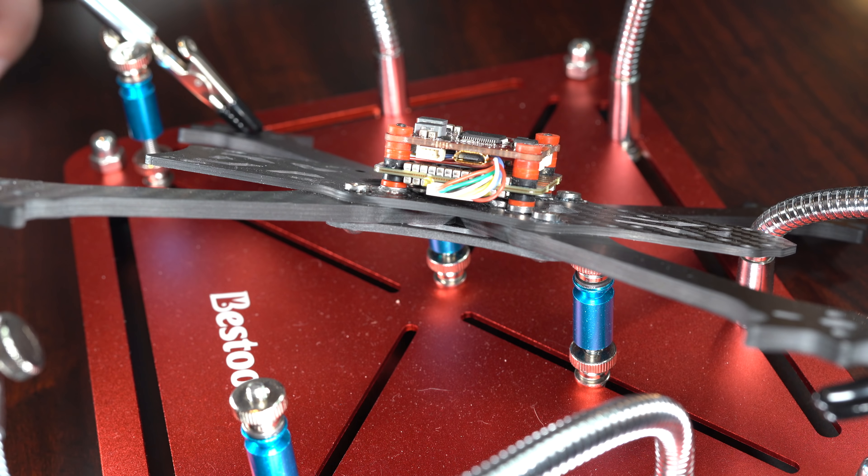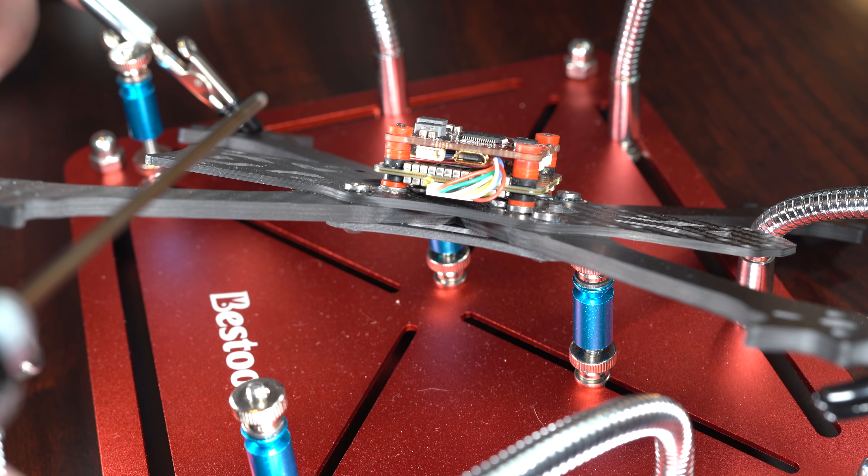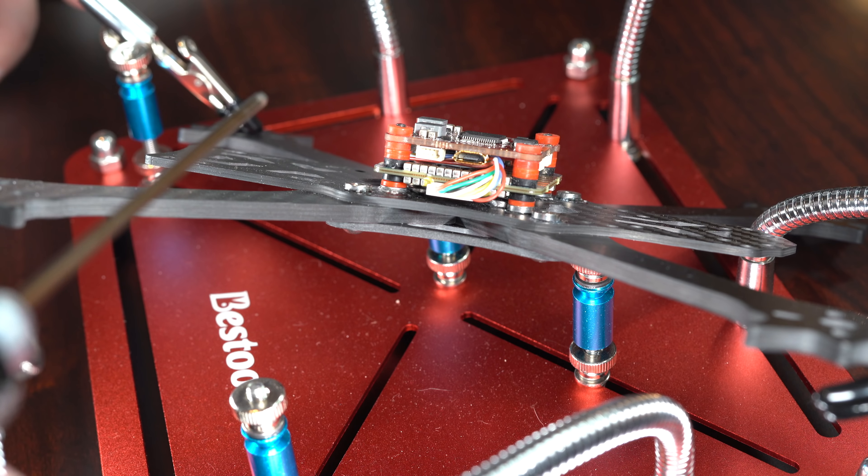I use skinny o-rings, though you might be able to use one thick o-ring in place of the two skinny ones. The key thing to keep in mind: only use o-rings — the gummies — in the ESC and flight controller. Don't use vibration standoffs or anything else. This is designed to mount with just a cheap long screw and a nut at the bottom, either nylon or metal.